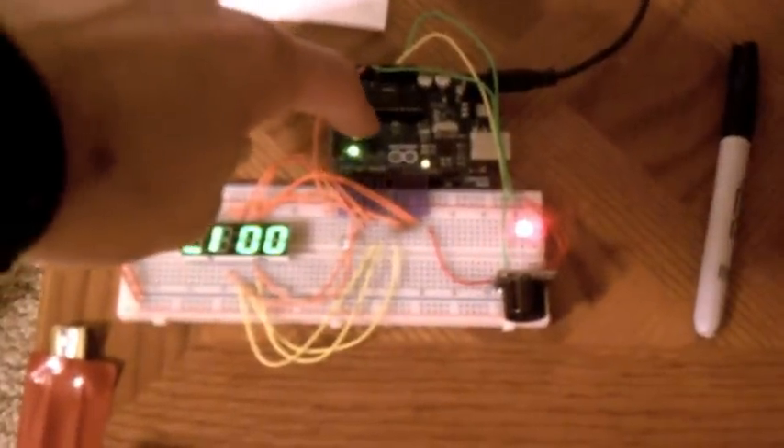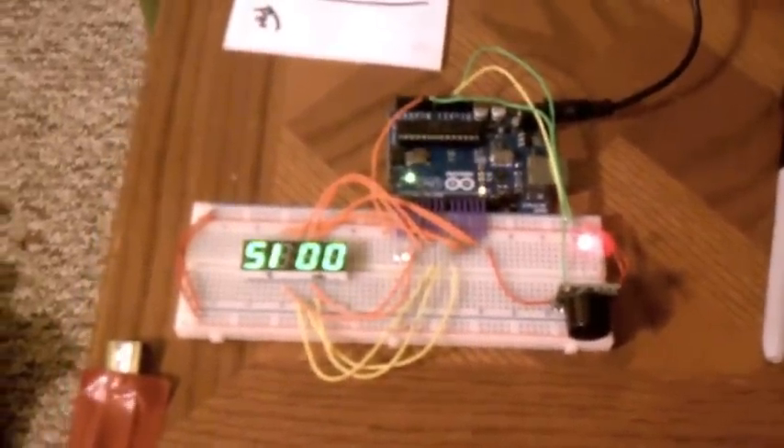In this clip I've got kind of a real-world demo. I'm going to start it over — you can see the startup sequence again, three flashes and then a quick flash. Now it's sensing. I've got my tape measure duct-taped to the table, and I've got a piece of wood which is a great reflector for the sound. I'm set up and that read 39 — it's upside down — and right here it's 41, so it's not bad. Backing up a bit, this is about as far as I could get in my living room. I was at 69 and this is at just over 71, so it's not bad for about 60 dollars worth of stuff.